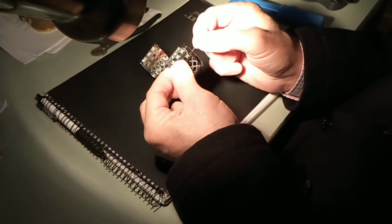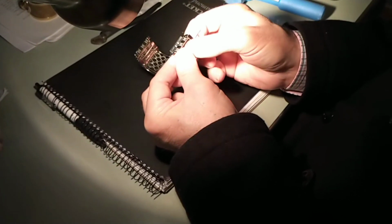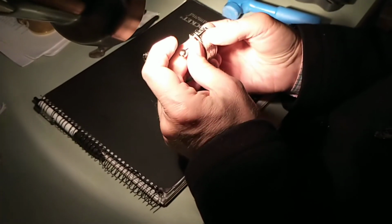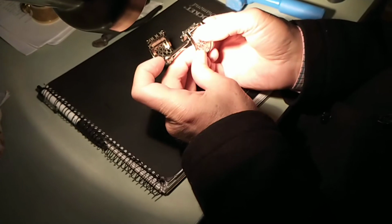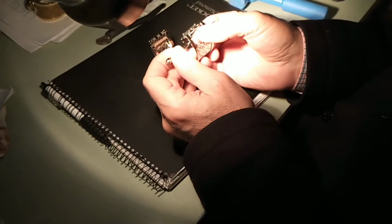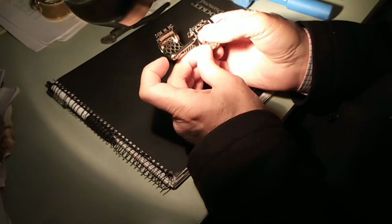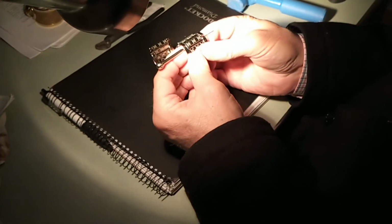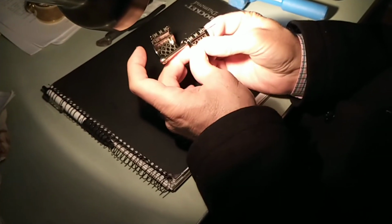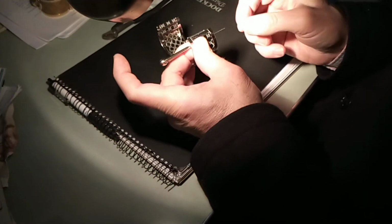You're going to have a couple of these thin pins left over because you removed some links. So for every link you removed, you'll have an extra one of these. So put in your 0.8mm tool here and then adjust with a little finagling. Can get it through that, all the way through the ear and entering into the slab there in the sleeve. There we go. Okay, so now as long as this pin stays in and this pin stays in, everything will remain aligned. Now, make sure this remains in.